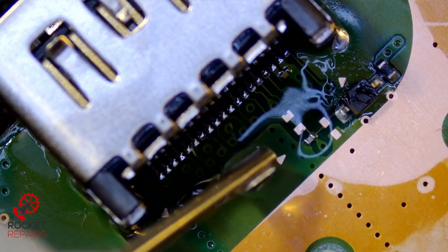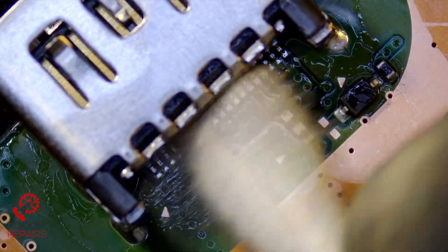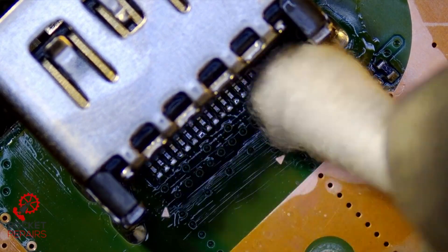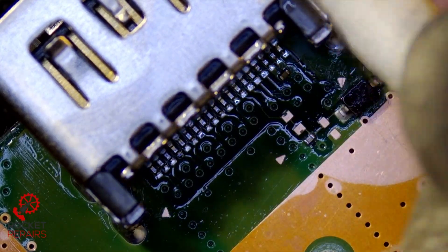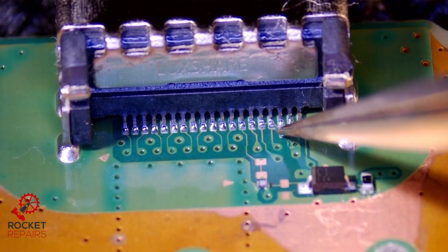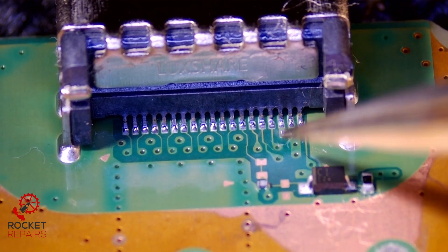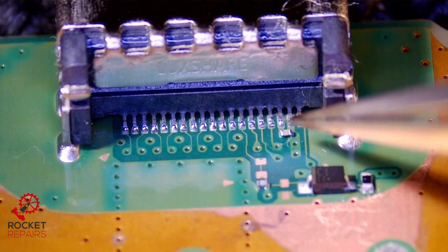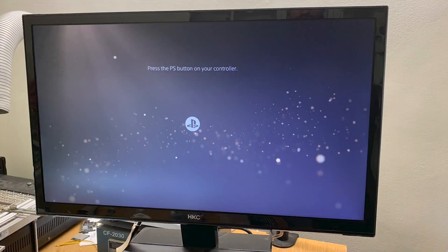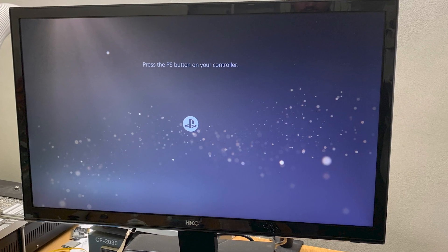You don't have to do what I've just done, but it gives it a nicer finish, and I do think it makes it a little bit more secure because the solder goes over the top of the pins. Could be a load of rubbish, but just the way I do it. This is the final finish — you can see we've knocked this cap here but it's fine, it's still connected to the pads, it's not going anywhere. You can see no bridges and a really tidy job, and the anchoring points — absolutely solid. I didn't actually record this one turning on, but here is a picture showing that it works. Thanks for watching and we'll see you in the next one.